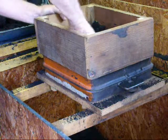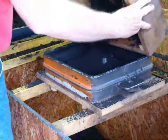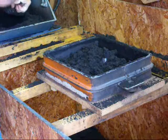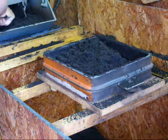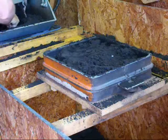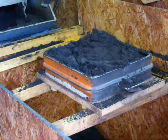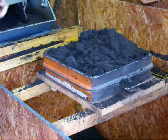Now, as long as you've got the patterns completely covered with sand — which I now do — you can just dump in the regular unsifted sand. I'm going to pour in sand and kind of spread it around. Remember where your patterns are, because one pattern projects kind of high and I want to be careful not to ram it and damage the pattern. You always need a little bit of extra sand because it's going to compact quite a bit when you start ramming it.